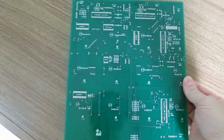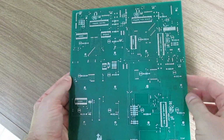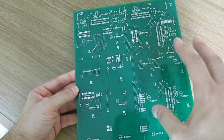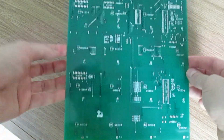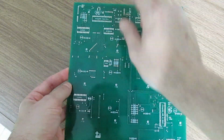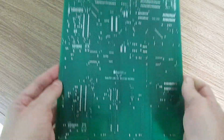Why limited edition? Because it has limited options. It doesn't have an LCD or SD card for storage, but it's the same PCB. So this PCB can be used for the limited edition and for the full versions, master or slave editions. And what happens here is that this board is very large because we have 16 steps on total here, and on the top we have some extra LEDs and components on the board, so it's very large, so we don't have to manually solder anything just on the board itself.